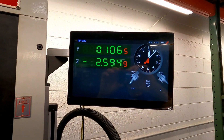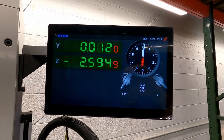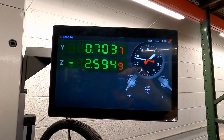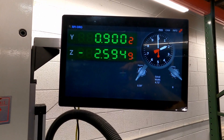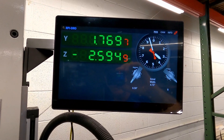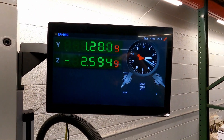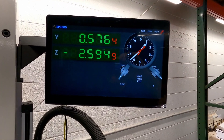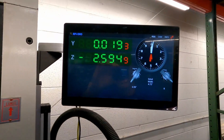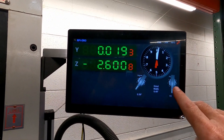Here's a close-up of the screen as I'm cranking the wheel. To make one pass, you crank the wheel below for one full revolution, then go back and forth grinding, then make another complete revolution. To return to zero, you reverse the whole thing until the needles get back to the top. Then you'd adjust the Z-height down a little bit and grind again.